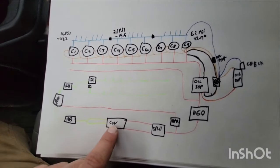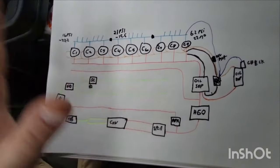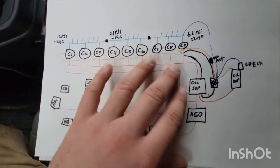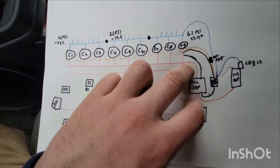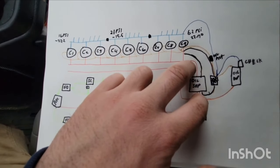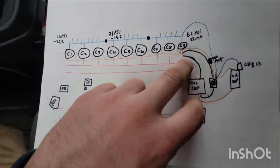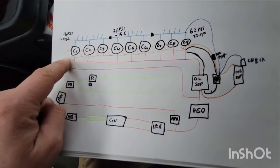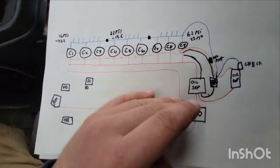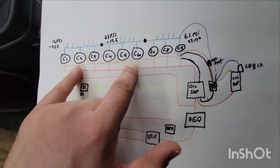But anyway, if you see that, okay, I even put a sprinkler on, it's not a hot day, and we still have head pressure issues, that's when you need to start evaluating the oil separator. Right here, you could have, let's say, a 30 PSI pressure differential across this. Okay, that's 30 PSI higher here than it is over here. That can cause your compressors to trip on high discharge. Over here, your hot gas differential valve. If it's holding back improperly, again, you can have a high discharge.